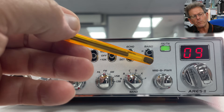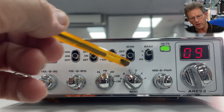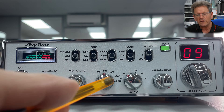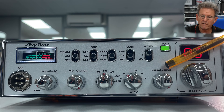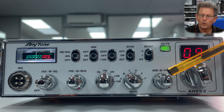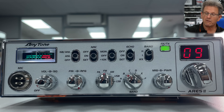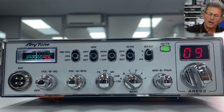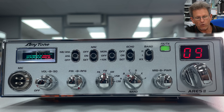In a moment when we go into the software, most purchasers of this radio will actually just stick to the frequencies they've set using the software and define which frequency bank. You have your mic gain and power gain control. This radio is rather exceptional in that it can produce up to 40 watts of FM power and 35 watts on SSB.